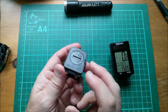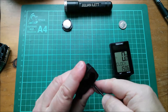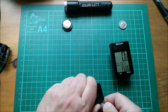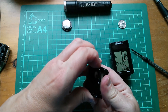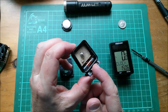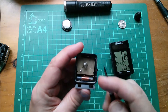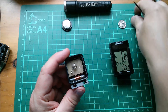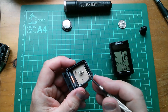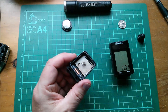I've had a couple of attempts at getting the transmitter cover off and it doesn't want to come off — I think it's glued. It's making some nice cracking noises as I dig this out. That's interesting — that's inductive. I was thinking hall effect, but it's actually got a coil on a ferrite. That's really unexpected. But wait — that's the antenna. Up there is a reed switch, and it's broken because it's made of glass. So this has been destructive, but I was listening for a reed switch click and didn't hear anything.